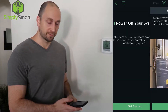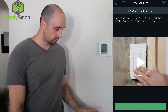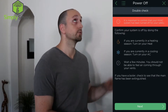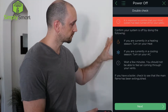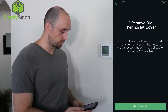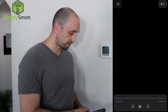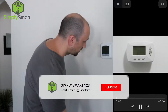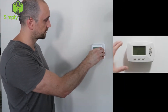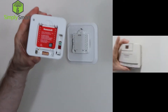I'm going to go ahead and power off the system now and I will be right back. Our system is now powered off, so now we can start to remove our old thermostat. Just make sure there's no air coming out of the vents and that your screen is blank. We're going to remove our old thermostat cover — every thermostat is a little bit different, but they all should about pop off just by a gentle twisting motion.